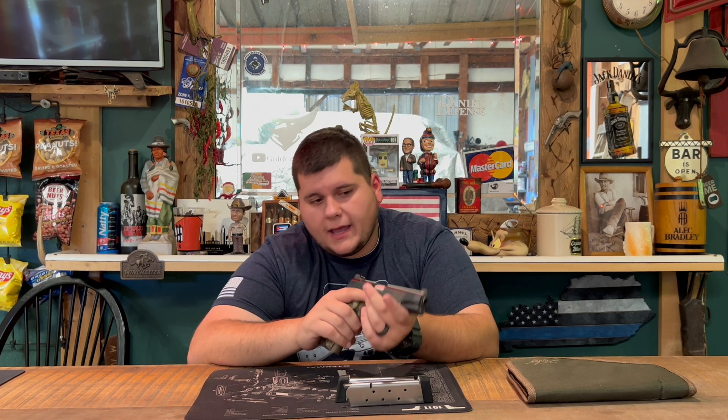In the first few rounds of that mag it was doing fine, but with the last three rounds it was failure to feed — nosediving every time. It might just be a severe magazine issue, but I don't know why it would have been working fine and then start having problems. Also, something else with this gun is that it kicked a lot harder than probably any other Kimber I've reviewed, besides maybe a Custom Two I had a couple of years ago where the spring was either worn out or too light — it felt like somebody was kicking you in the hand with a mule. I've reviewed more 1911s than almost any other pistol, and something I've seen with lower-end Kimbers is that they put way too light of a recoil spring in, which causes the gun to kick severely.